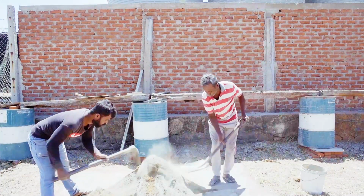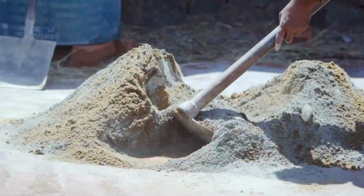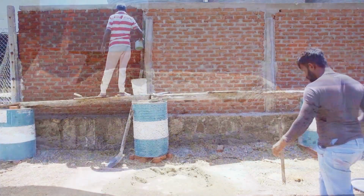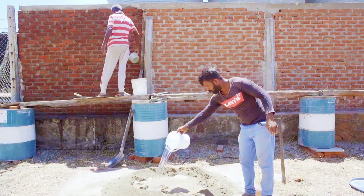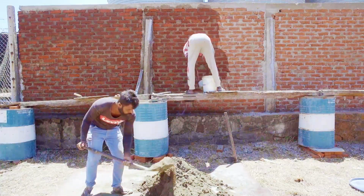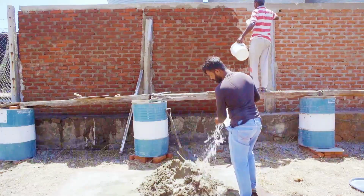And see this? This is the mixing site. With varying amounts of water and cement, the plaster varies in quality, strength and texture from wall to wall, leading to an inconsistent finish. Despite that, the whole lot cannot be mixed at once because it dries off quickly. To adjust consistency, arbitrarily adding water and cement will reduce the strength of the plaster.